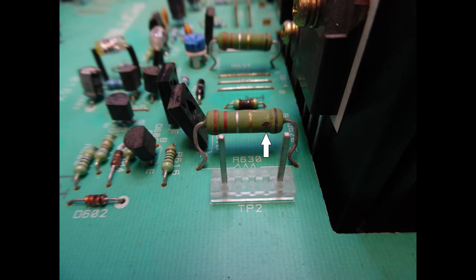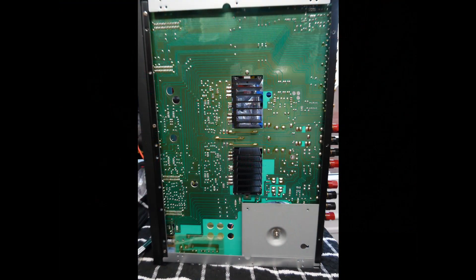Just in front of the burn mark you can see TP2, which we'll come back to later in the tutorial. The amplifier is shown upended — a really nice point about this amplifier is that it has a bottom plate you can remove for service, giving you full access to the circuit board. The circuit board quality is very high: the circuit tracks are good and the solder connections are very good too. You don't often find dry joints on these Rotel amplifiers, but as a matter of course I'll scan the board and reflow any connections that look slightly grey.